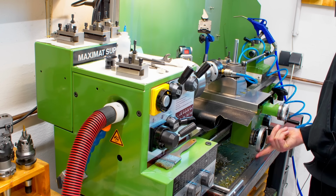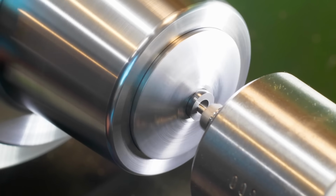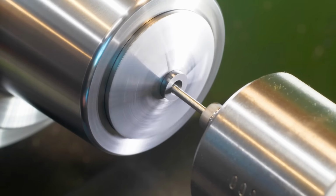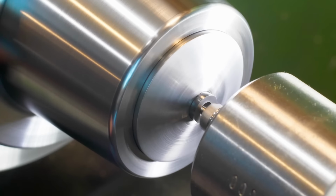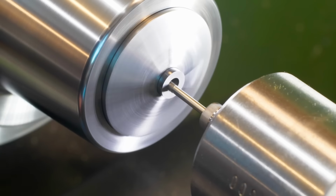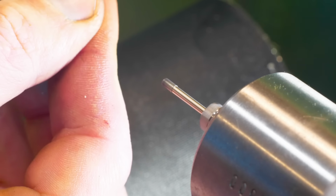After I took everything apart, there was literally close to no carbide dust in the collet. I was surprised how easy it is with this setup to hit dimensions to size. The feedback loop from grinding to checking the ID of the bores with 10 micron incremented gauge pins is very short, and you can very quickly adjust, especially using the DRO.